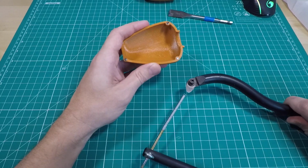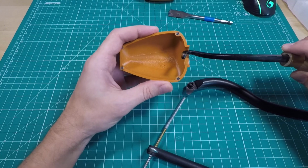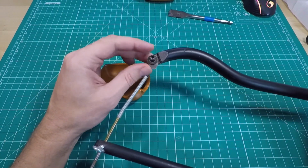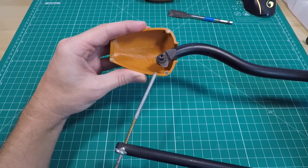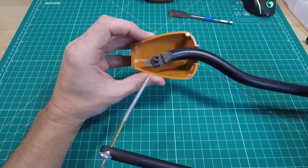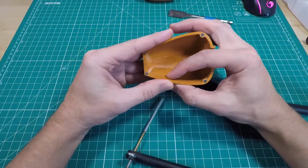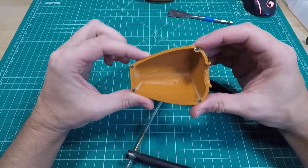Smaller tools can also be used to refine the neck area. The main tool's cutter can also be adjusted to reach different areas. Wood chips have to be removed often to prevent chattering, and I use my fingers to test the wall thickness. This entire process has to be done mainly by feel.